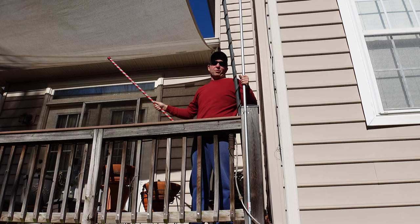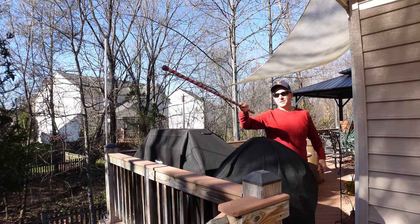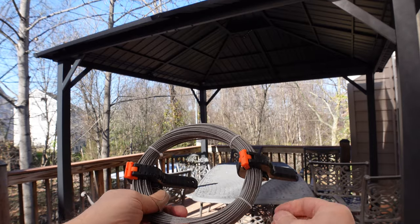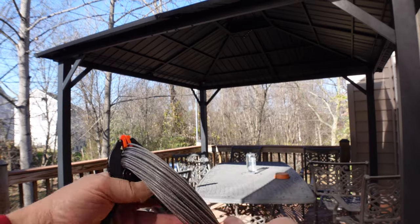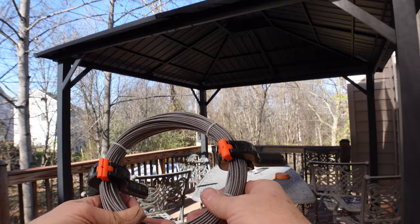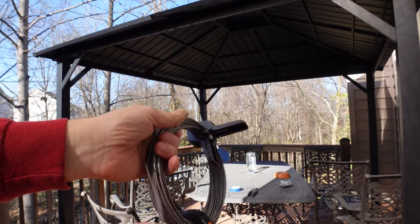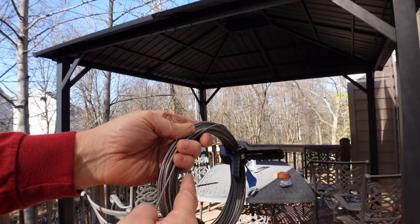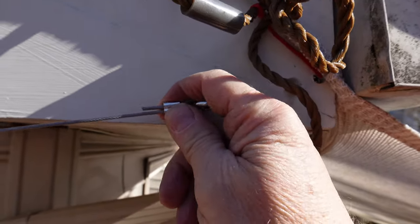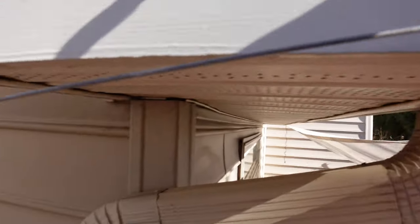All the poles have been installed and fixed in two places with really beefy ties. Here are the poles for the lights. Pro tip: wire comes in bundles and looks nice, but when you pop the cable ties it can spiral out of control. I put little clamps in place before popping the cable ties so I can control the cable, let it out, mount it where I want, then put the clamps back. I also mark the far end of the wire so I'm only using the one wrapped around on top.